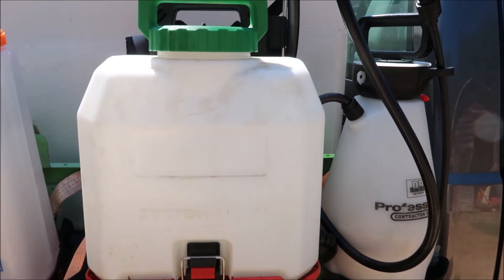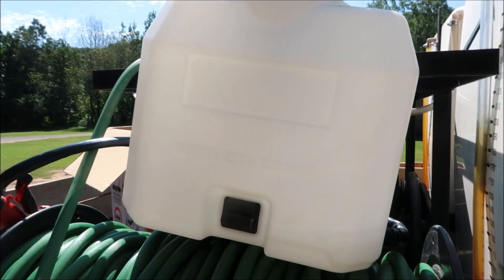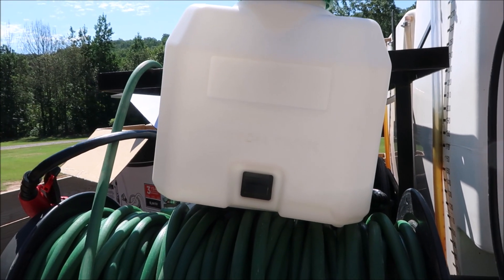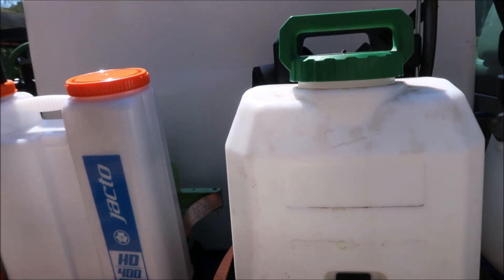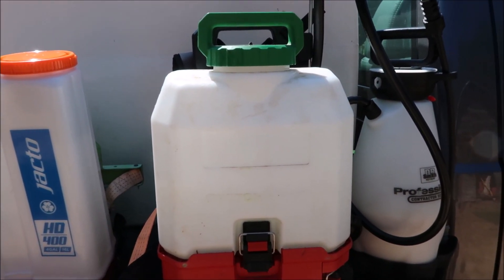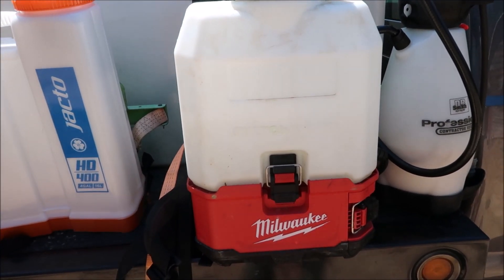The switch tank is kind of a big selling point on these. You've got this tank on here and there's a separate tank. What that means is you could fill it up with two separate mixtures, or just have an extra tank with the same mixture. When you run out you can just switch it over — there's a buckle on the front and one on the back and you literally just lift the tank off, set the other one on there, and you're ready to go. Yesterday I was spraying and just switched the tank over and kept going without having to remix out in the field.